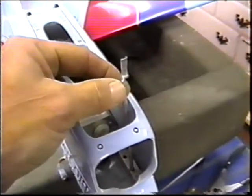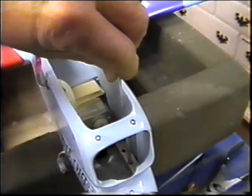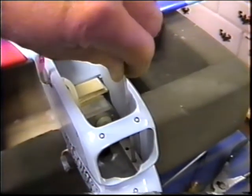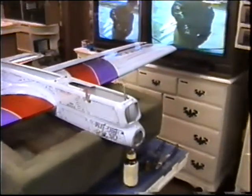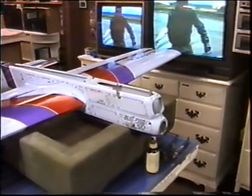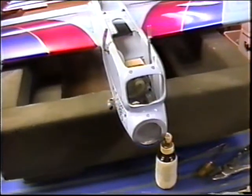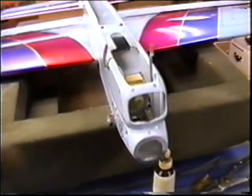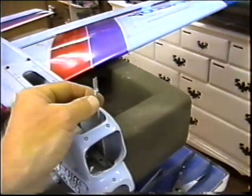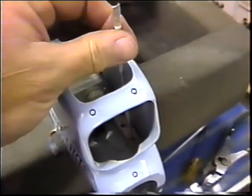What I'm going to do is cut this off and drop a few drops of hot stuff down in there. Let it kick and then see if I can back-thread this out. And I'm not so sure this is going to work. But one of the things I always do is show the mistakes as well. Not a mistake. This is something that's probably worth trying. I really do like to have four bolts in this if we could. All right, let's cut this off for us. And then we could drop some CA down through that tube. And I'm hoping this is going to work.